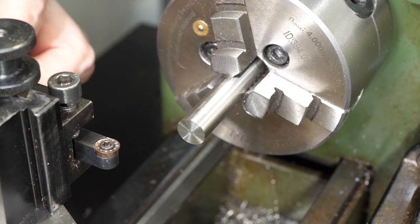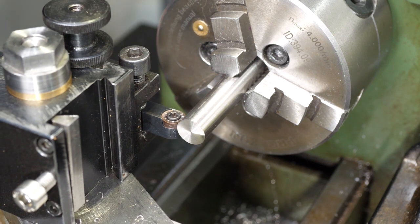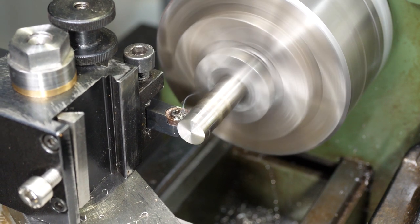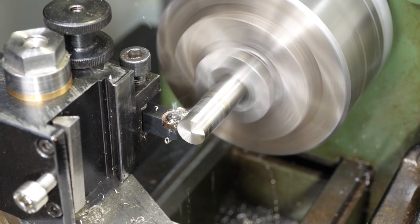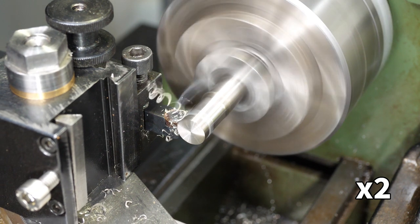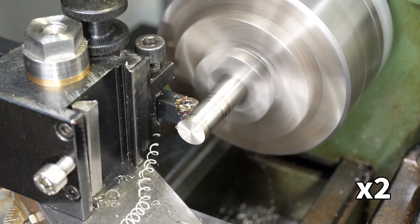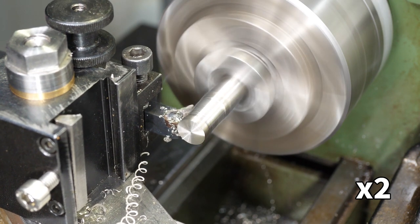I thought I'd try using a round radius insert tool to shape the rod into something I could hang a coat on. A wide groove with curved edges should be able to hold the hanging loop of a coat, even when it's mounted horizontally. As the tool is round, it cuts equally well in both directions, which should help ensure a similar surface finish at both ends.